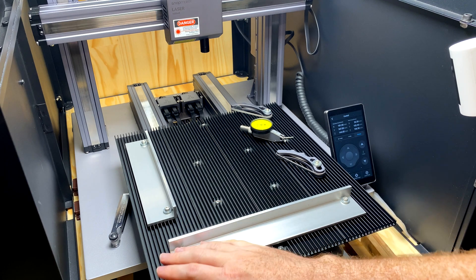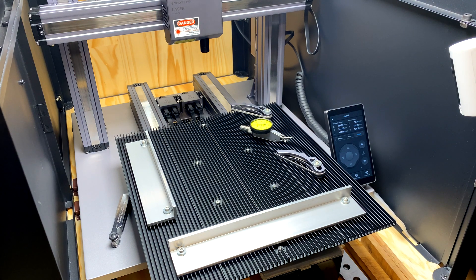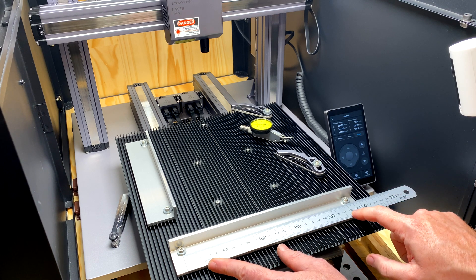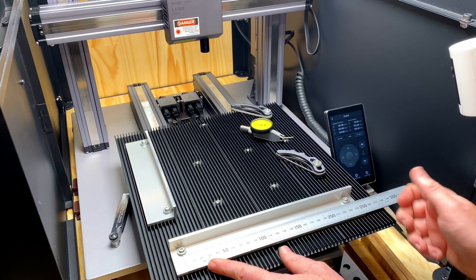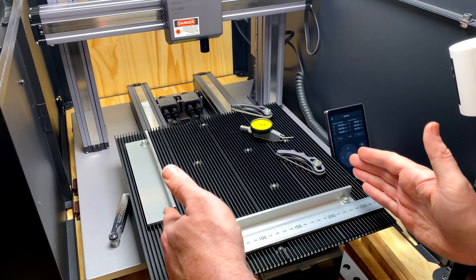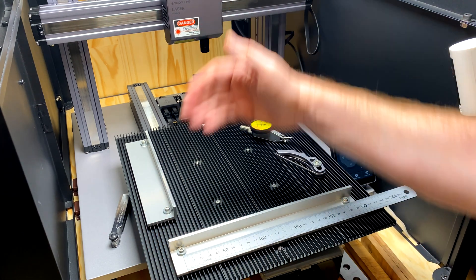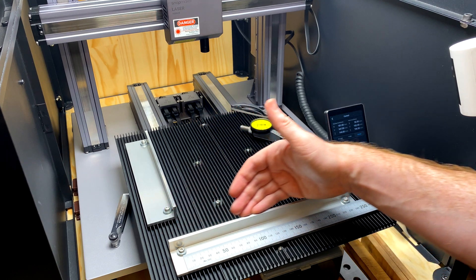You need to drill these holes slightly oversized and have a bit of wiggle room on each side so you can work it and figure out where you want to be. Even with just hand drills at home you can probably pull this off - just take the holes a bit bigger than you normally would, give yourself some free play, and use a nice thick washer to clamp down when you tighten it. The hole distances on this machine are around 230-234 millimeters - measure your own holes before drilling anything.